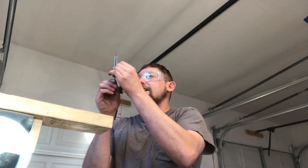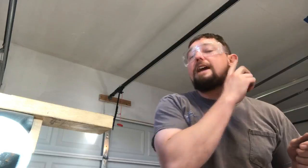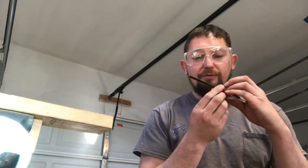They'll cause reeds to come loose. They'll cause premature rattling. When you're playing a harp and you hear a ping, like for me, I hear a ping in my left ear, like down near my jaw. That's a loose crimp, just barely rattling. Now we know we're in there good. This is the way I do this here.